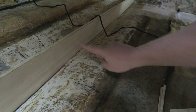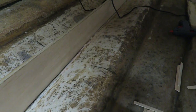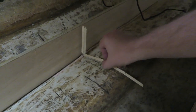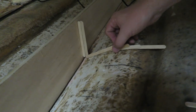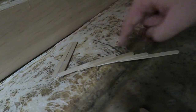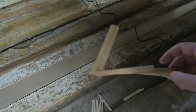I started working out how to build a triangular bracket that follows the shape of the hull and comes up and across — just one piece that goes in there. I was looking at cardboard templates, but we've got the hot glue gun and that worked for the transom, so I tried it here. All I've done is gone through with the hot glue gun and some paddle pop sticks and basically made a perfect little template that is the exact curvature of the hull — just paddle pop sticks glued together, with a couple glued at the end to get the spacing correct. Then we take that over to the plywood, trace it out, and you've got what should be a perfect piece straight off the bat.